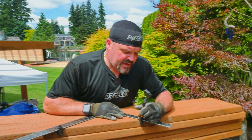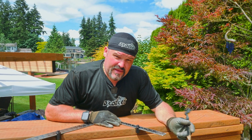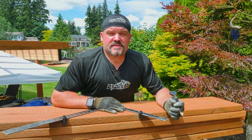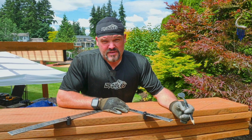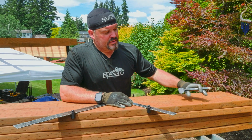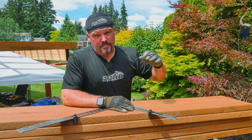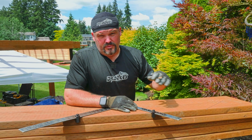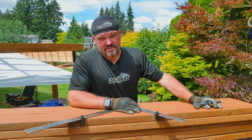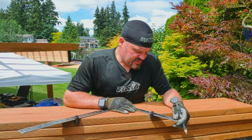Okay, but now that I can keep going, I'm gonna look at my backside mark, because I always had a problem trying to figure out exactly where I should put the front nose of this, okay? And that becomes kind of an issue when you're doing stair layout, because the more accurate you are, the better it's gonna be for the overall health of your stairs. Also, you don't wanna have more than a 3/8 inch difference in any particular rise on your stair set. Top, bottom, middle, whatever, it'll never pass inspection. Inspectors always check to make sure your rises are the same, at least mine do. It's one of the stickler points around the Pacific Northwest, apparently.